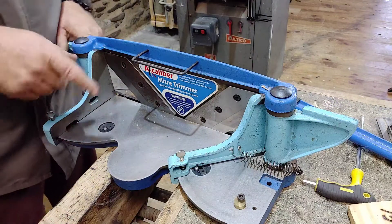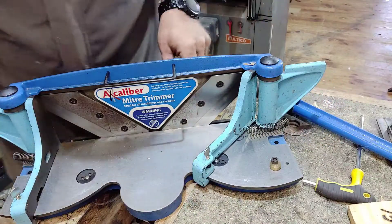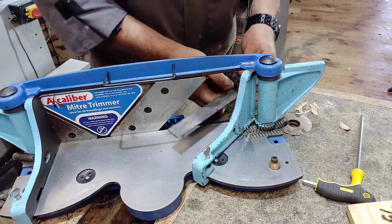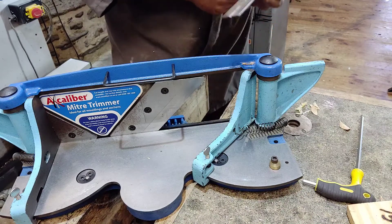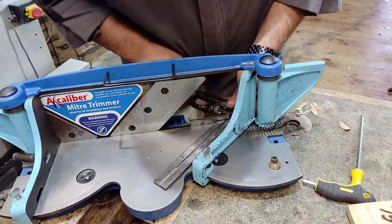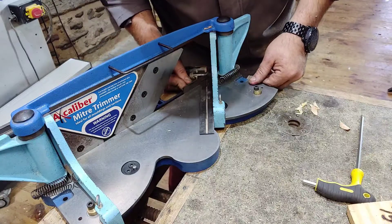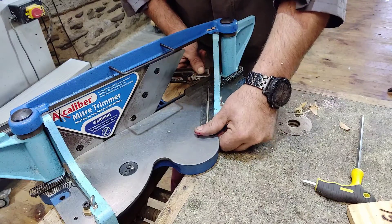The next one I'm going to do is the 45. I've already set it to 45, so it should be bang on. But I've only actually set it to 45 using the mitre. So let's pull this out of the way — hopefully I don't cut myself again. I've got my claret — bleeding from my fingers. So I've got that on my fence here like so, on the side of this guide here, which carries the blade itself. I bring that down and across to the fence, and hopefully it makes contact all the way along the rule without any rocking. And that is — that's perfect.